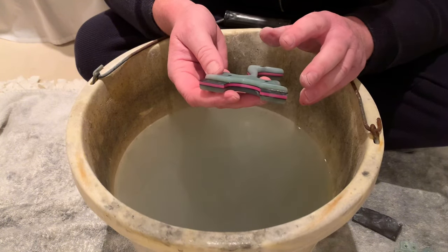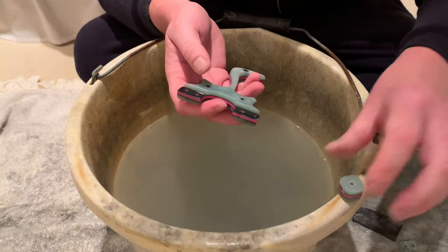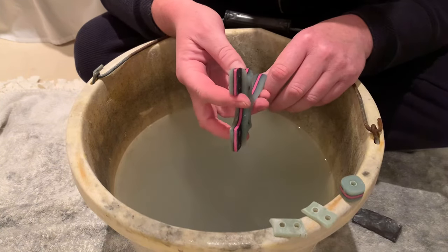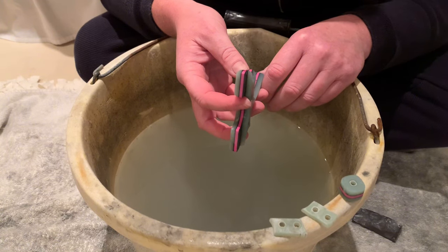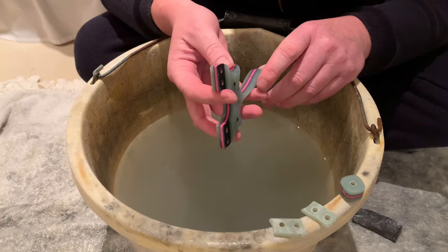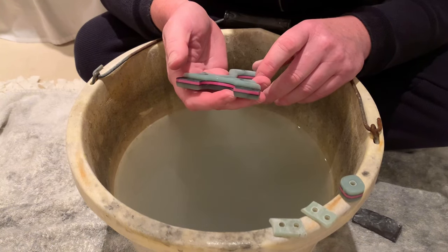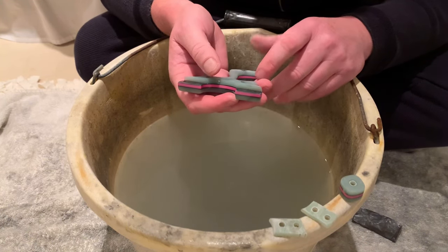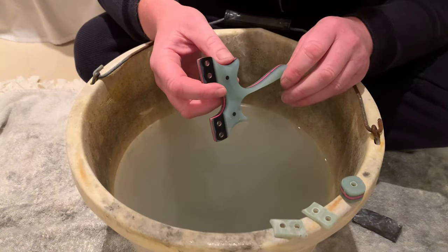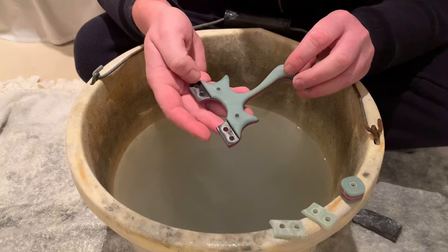On its own I find 800 grit to be the best finish for G10. The bead's all done, the clips are all done. I'm going to rinse this over and then polish it — using an Auto Glym metal polish which works really well not just on metal but on everything else. I'm going to work it in by hand with good quality toilet paper — I find toilet paper is better than kitchen roll for this. Next time you see this build it will be polished and finished.